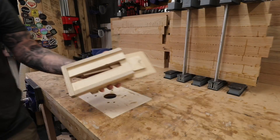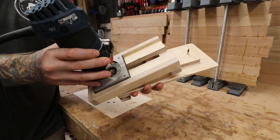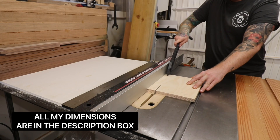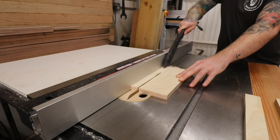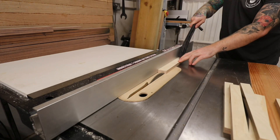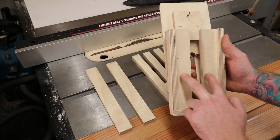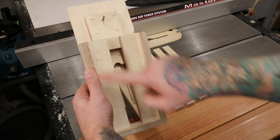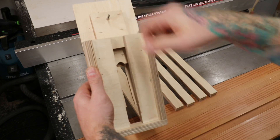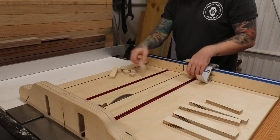The best place to start is the base that the router will slide on. Each router will obviously be different in size and shape, so cater this for your own specific tool brand. I'm going to first cut out some strips on the table saw from some scrap 15-millimeter, aka half-inch, plywood. Two of the strips are wider for the router base plate to ride along, and the remaining four — cut slimmer — will be for guides, a rest stop for the router, and a top section so it doesn't wobble. The base of this trim router is roughly 88 millimeters, roughly three and a half inches.